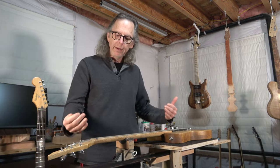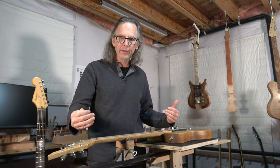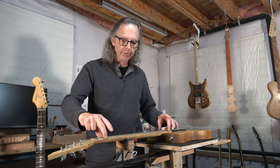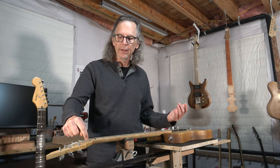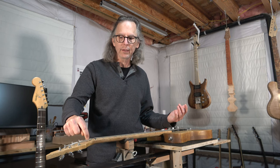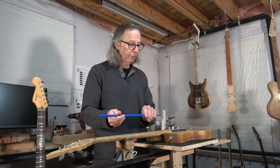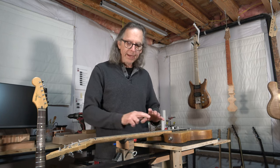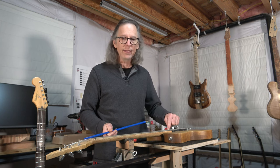So when you're planning your build, you have to ask yourself what makes sense. If you're making the neck out of a strong hard maple, you can go ahead and add the truss rod adjustment nut at the headstock. If you don't like the way that looks, of course you can flip it around. If you're making the neck out of mahogany, I think it's a good idea to put the adjustment nut at the heel.